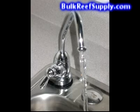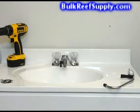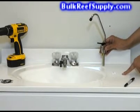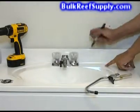The first step of installation is to install your faucet. If your sink already has a hole for the faucet, go ahead and use that one. However, in many cases we're going to have to drill our own hole. To drill the hole, the first thing we need to do is locate a suitable spot. Make sure the faucet is installed close enough to the sink so that when the unit is turned on, the water sprays into the sink rather than onto the countertop. Go ahead and use a marker to mark the spot that you want to drill the hole.